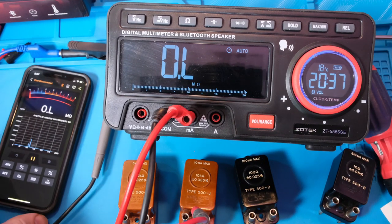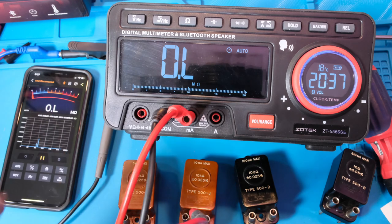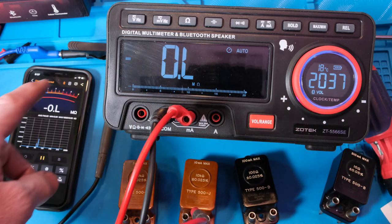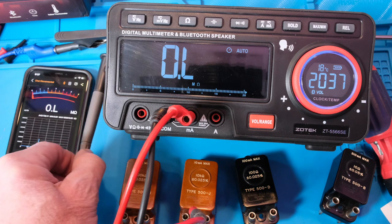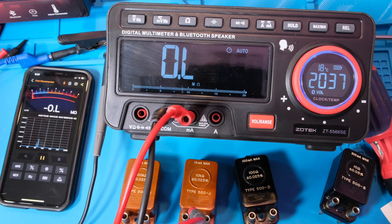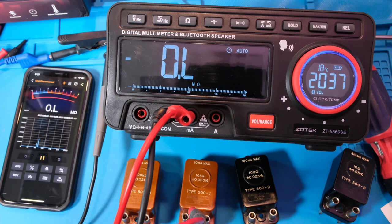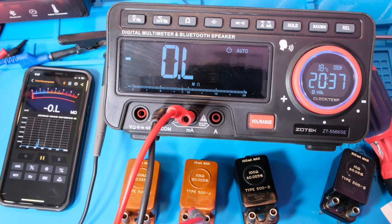All right guys, let's take some current measurements, okay? What I've got is I got my power supply up there going to a load, and then out of the load, coming into this lead right here, okay? It's connected down here, and coming up in here. And then this guy goes to the other end of the power supply, okay? So we're gonna run some current through a load so I can control the resistance, and I think it should be actually happening right now.